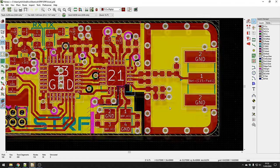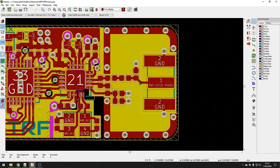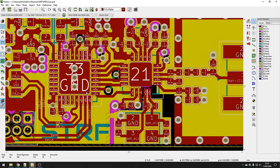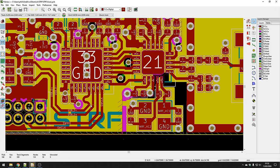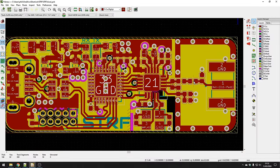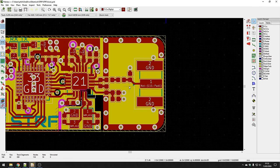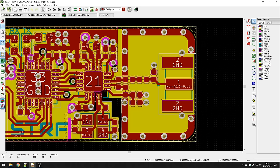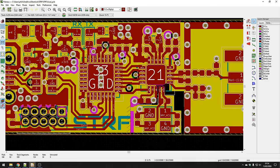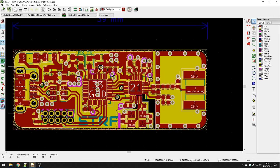To summarize RF routing: ensure an uninterrupted ground plane, matched RF traces with correct impedance, and matched skew for differential pairs. Also keep clearance between high-speed traces — I've left quite a bit of gap between the RF traces and any other high-speed traces such as USB or SPI. On a small board, try to maximize the clearance between high-speed traces to minimize capacitive crosstalk and cross-coupling. Follow the manufacturer's recommendations throughout.